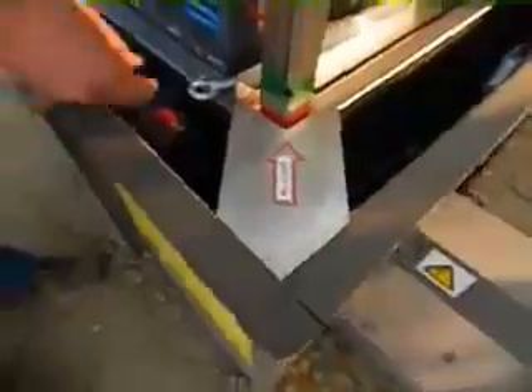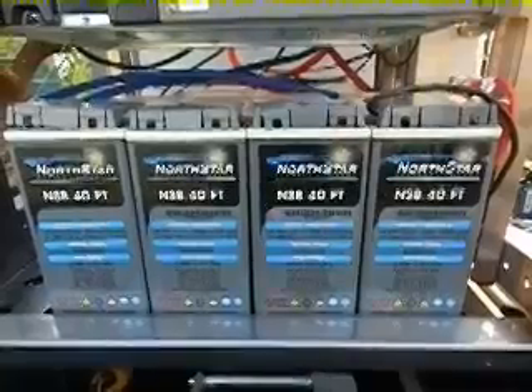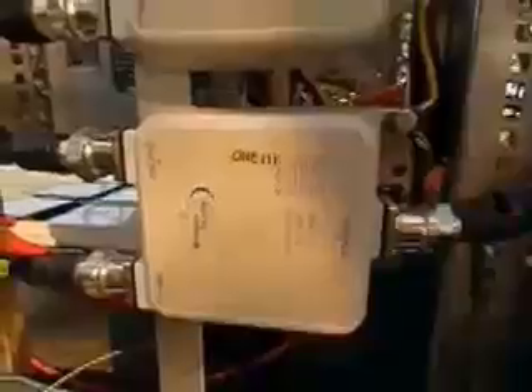You can see a safety pin to make sure that the unit is safe while being worked on. Batteries are provided at the bottom. There are six diplexers for six radios — in this case two radios per sector, one data UMTS and one 1800 voice. Battery backup is 170Ah.